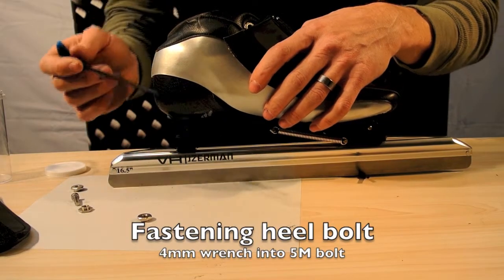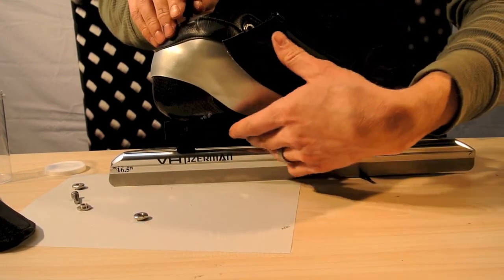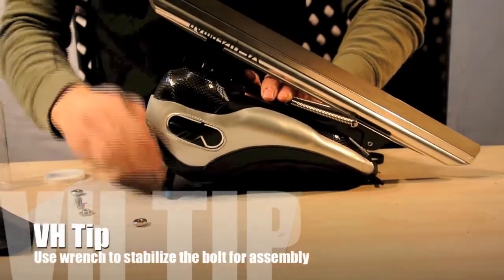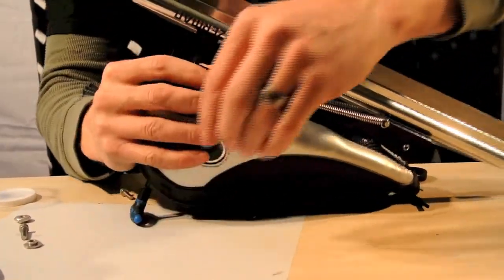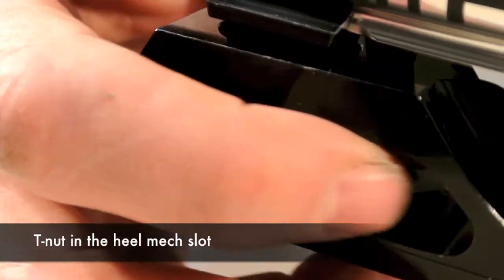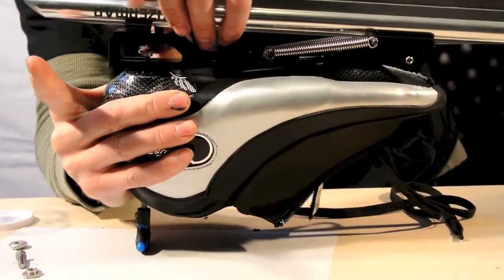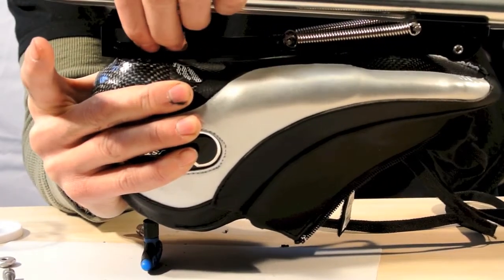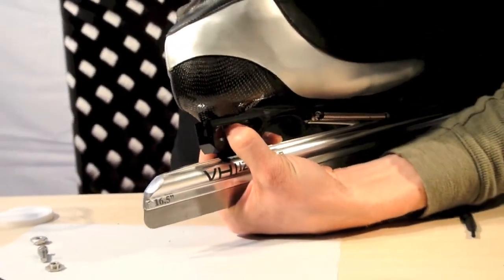For fastening the back T-nut and bolt, we're going to put the tool into the hex head of the bolt, and then we're going to rotate it and actually let it rest on that tool. Now that stabilizes the bolt, now we can come and take the T-nut and actually thread it. Once it gets close, get it into the slot there, and we're going to rotate back, and now we can use the tool to finish.